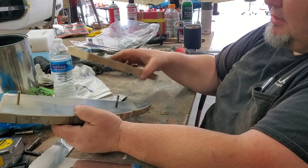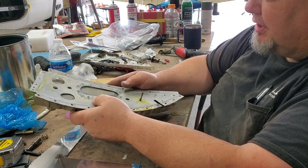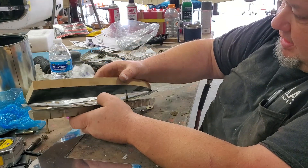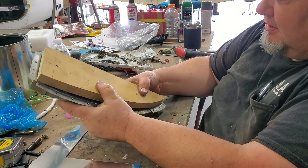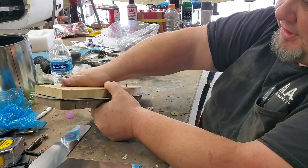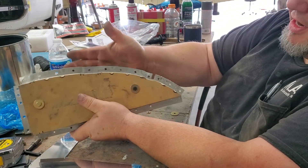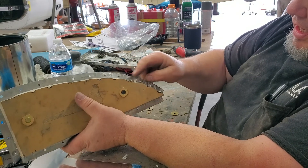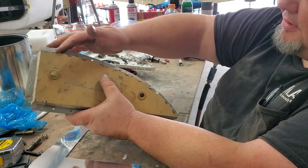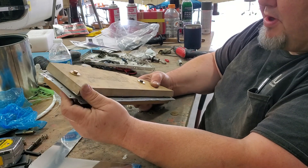The other part of it is the top block. You can't just put a piece of metal on here and bend it over — I mean you could, but you'll result in big bowing, it'll just kind of ripple over. So you need to take this top block — you can make it out of MDF like I did, or out of steel plate or aluminum — and it all gets bolted together. These are more or less alignment pins but they also pull everything together. Then I'll stick this in the vise and pound this flange right over into here, taking up the scallops and joggles, so you get a nice formed piece just like the original that came out of the airplane.